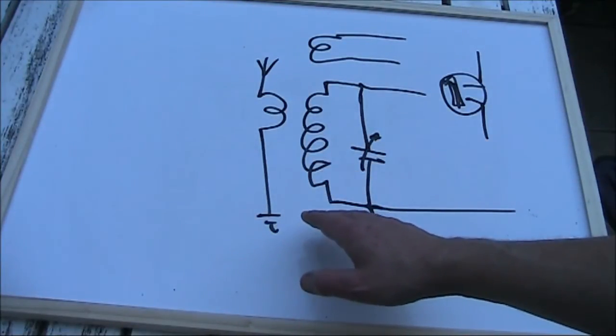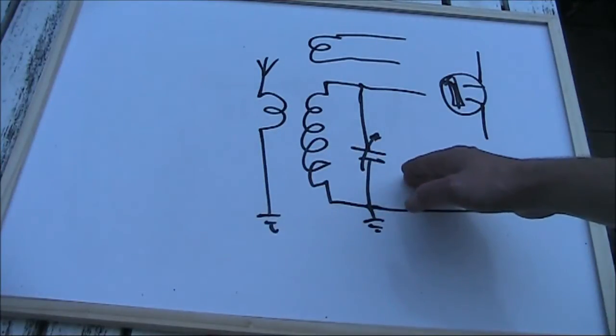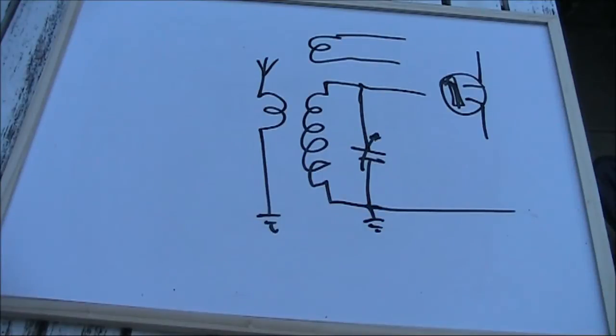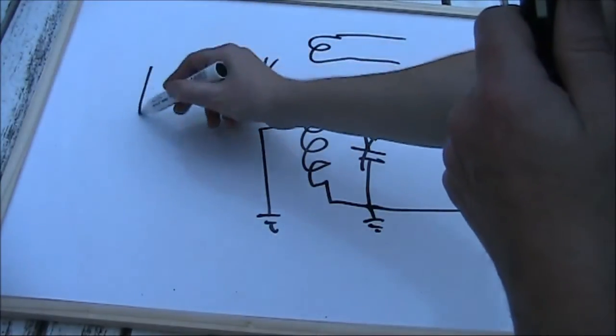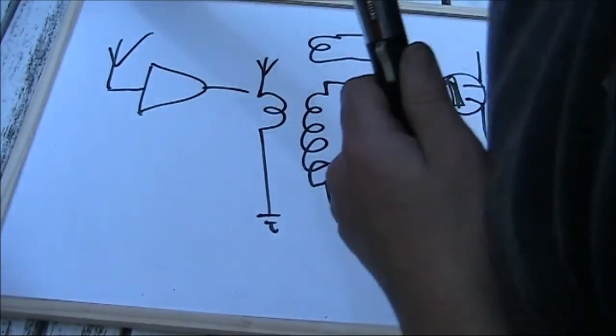It might be difficult to make precise tuning adjustments. There may be more frequency drift, as a regenerative receiver is essentially a free-running RF oscillator. And gain may be lower — you may not be able to hear weak signals on the higher HF bands. Not all those can be fixed with such a simple circuit, but if you wanted to sort out the gain problem, you could add an RF amplifier. These deficiencies are why regenerative receivers are generally used for the AM broadcast band and the bottom few shortwave bands.